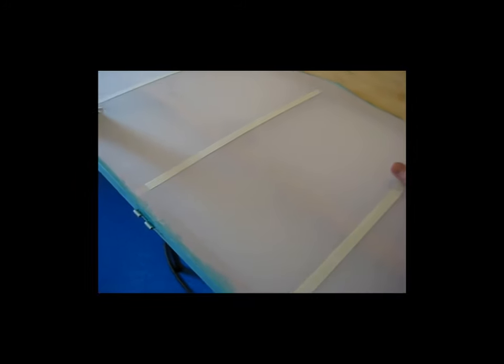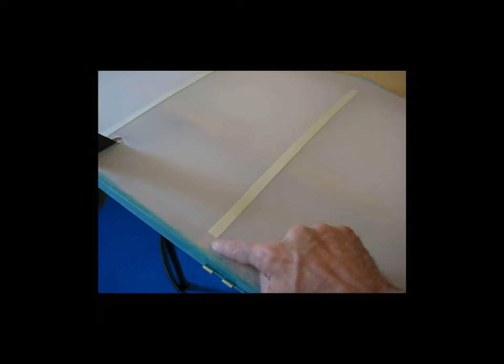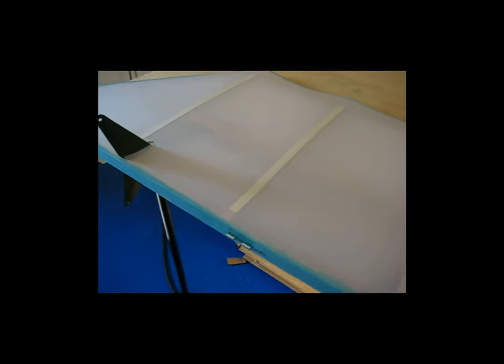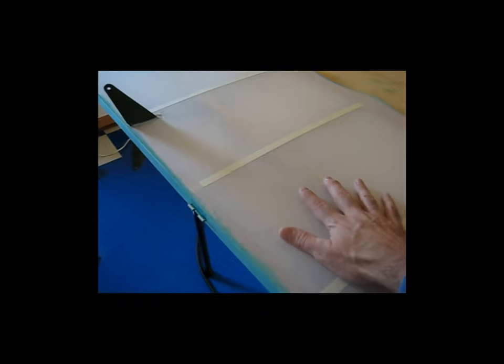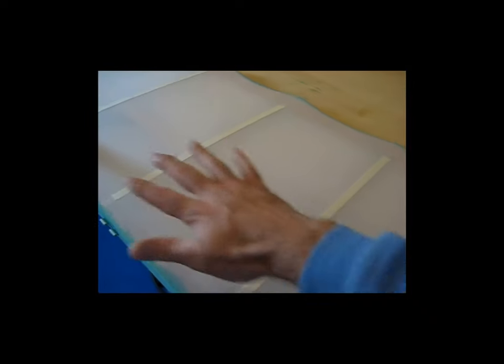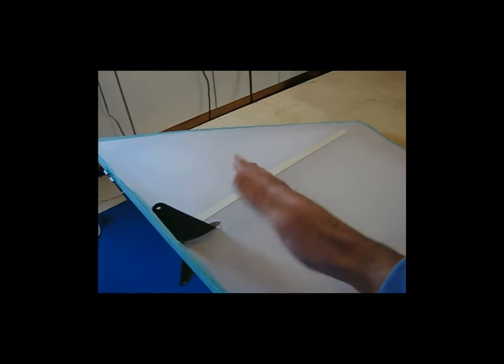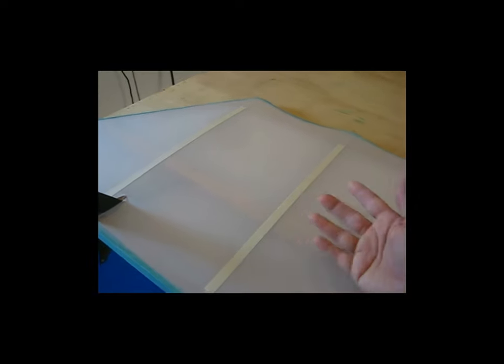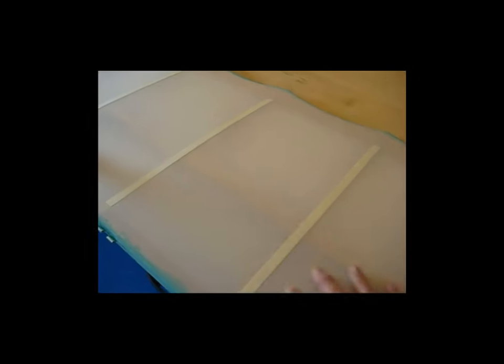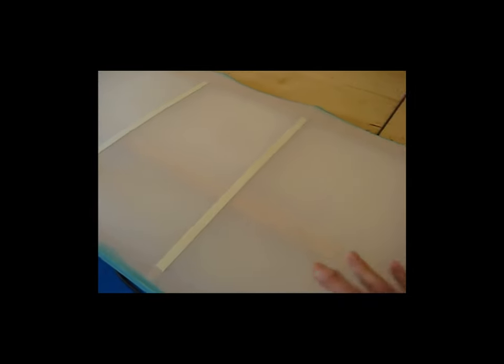You put your half inch reinforcing tape right on top of the ribs. You can see the ribs showing through — these lay right on top of the ribs, both sides. One thing I wanted to mention: when you do the final shrink, you want to even out the heat. Don't final shrink one entire section and then do the next section. You want to move around — do a little corner on this side, then flip it over and do a section on the other side. Keep flipping back and forth, moving the heat around so that you don't warp the panel. Put a little bit of heat on it, flip it over, put a little bit of heat somewhere else, flip it back. Once you get it all pretty well tight, then you can go over one whole side and then flip it over and do the other side. Move it around, keep it uniform, and keep it from warping.